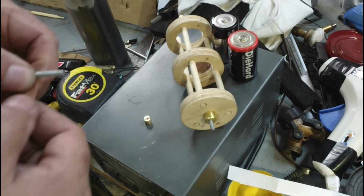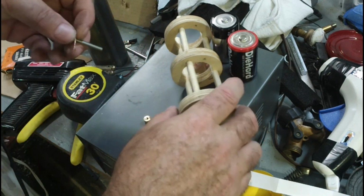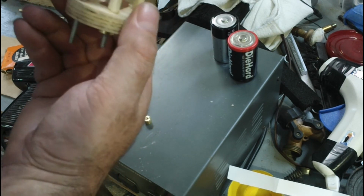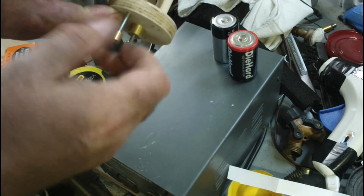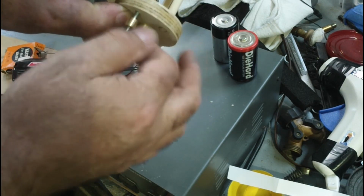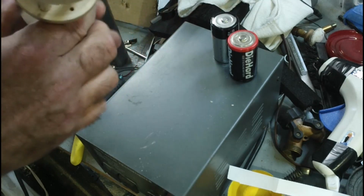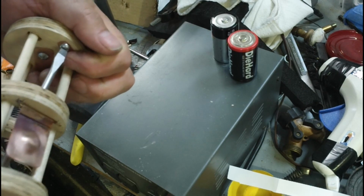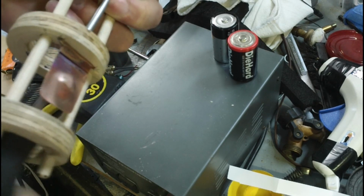And then the negative. These are not 100% accurate, because the positive on most of these, instead of being half inch in diameter, is actually about 3/4 of an inch. But for the casual observer, these look close enough. For the most part, the negative is actually attached to the very side of the battery, and most of them have a little L-shaped piece that comes up. This is offset a little bit so that the muffler pipe is not conductive, or bonded to the negative, and that way it's a lot easier to not short something out when you're putting it together.